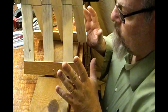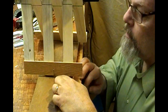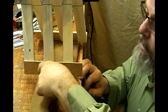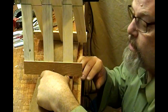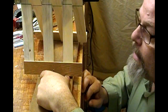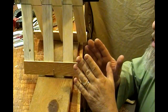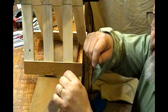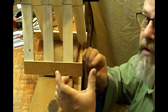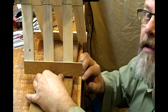That's great. Okay. Now, usually what I'll do is I'll drill a hole. Okay, and then I'll put a dowel rod in here. And they have a series of holes with dowel rods. I might even do two of them, depending upon how my jig is and everything else, to make sure I hold it at exactly the correct angle. And if it's a little off, I'll usually want to have it a little bit to where it's out, because then I can add tape and other stuff to those dowels or that dowel, to bring it into exactly where I need it.